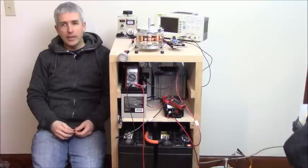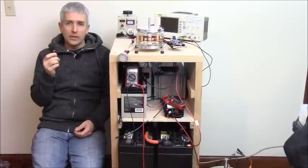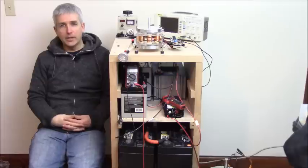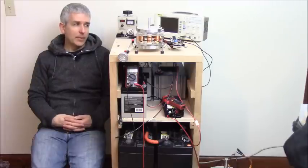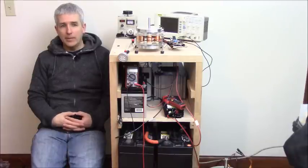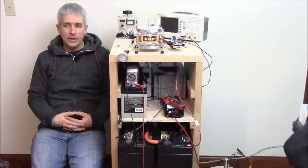What I want to do is prevent reaching that maximum limit, because then it will rely on the MOSFET's internal diode. There's a fast switching diode in there, and once you get to that maximum, it will heat up and damage that, and that's where you're going to find your MOSFETs heating up a lot of times, when you're switching on slow or fast, or that's a different problem, or when you're actually exceeding its maximum limits. I've said many times that many people do experiments and immediately damage their MOSFETs, not realizing that, and they'll never get good results right from the very beginning because they've damaged the MOSFETs.